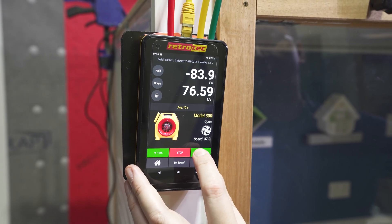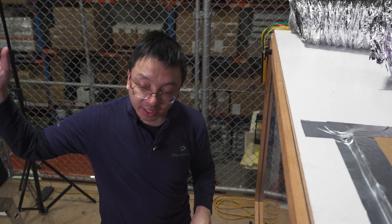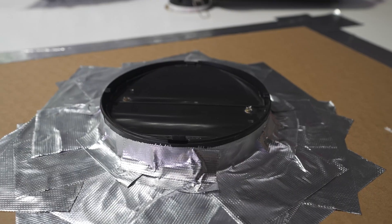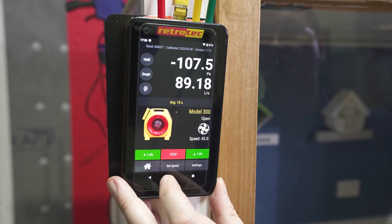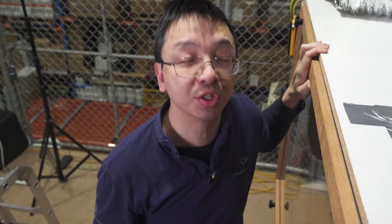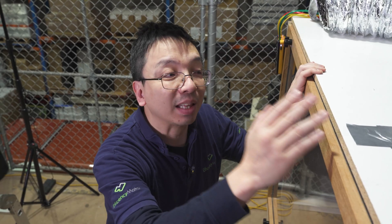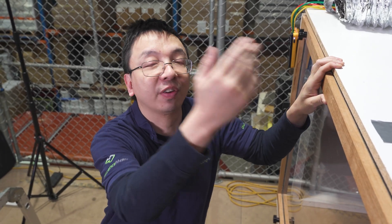Let's raise the pressure a bit more. We are running at around 90 pascal inside — that's almost gale-force wind going across your roof and exposing your exhaust chimney to the same level of pressure. As you can see, the Draftstopper is still not opening. It is not until we get to around 100 pascal that the Draftstopper opens up. When we expose it to around 100 to 110 pascal, it opens — that is the typical operating pressure of an inline exhaust fan or kitchen exhaust hood. That way, we can ensure that unless you run your exhaust system, local wind is not going to lift up your Draftstopper.